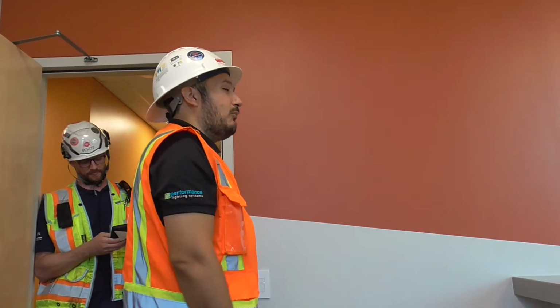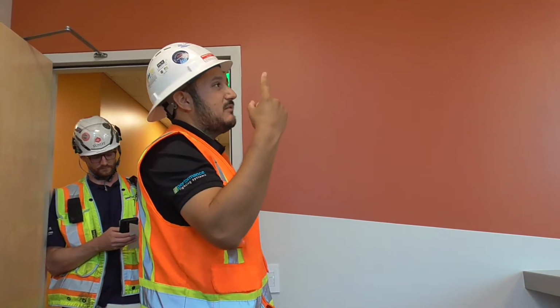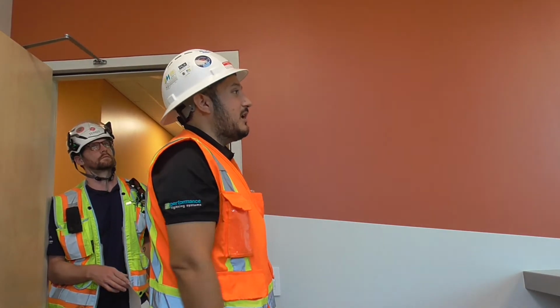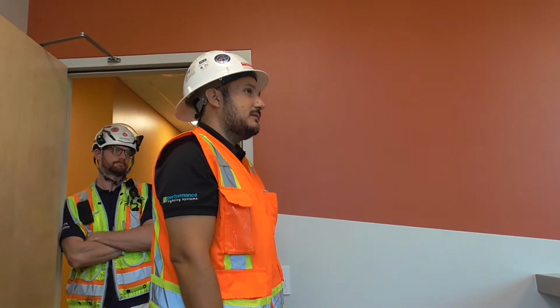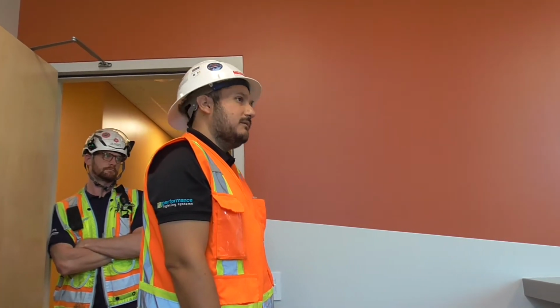Once you lose that normal sensing power, these emergencies, which probably let's just say there's 4 in here, will turn on, go to 100% full bright, and this switch sensor will not be controlling them until you get that normal power back on. Is this system tied into the fire alarm? That I'm not aware of. This system is not technical. No.